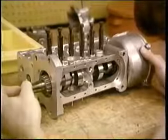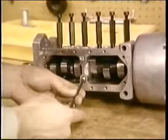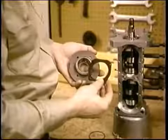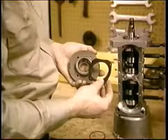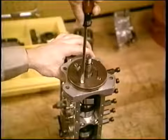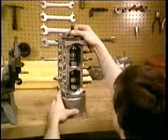On most pumps, that includes the center bearing. Tighten the center bearing as specified. These shims on the bearing plate determine the camshaft end play. After you install them and screw in the plate, rotate the camshaft to be sure it's free and the bearings are seated.